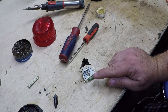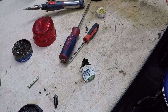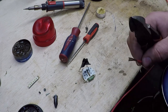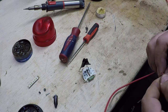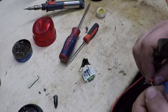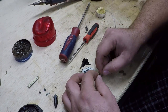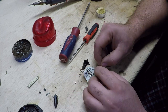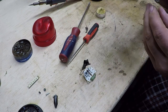We've got to fix that trace across there, so we need some wire. That trace is pretty small, so what I'm going to do is twist a couple of these conductors together before I cut them off. Because it would be pretty difficult to twist them together after I cut it. We're going to just lay this piece across those two points and solder them in place. Hopefully I didn't make that too long — well, yeah, of course I did. Why wouldn't I have?